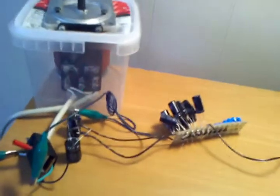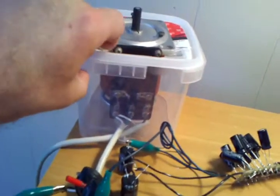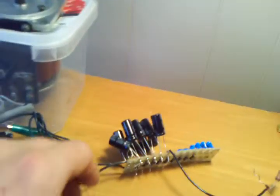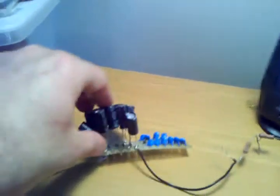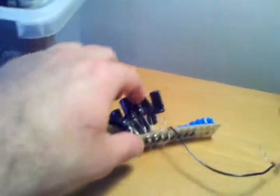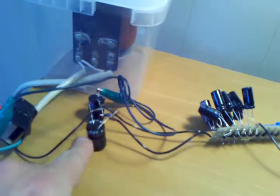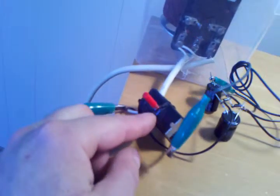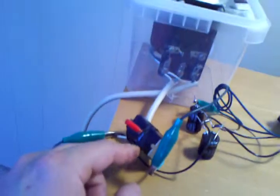This is how I made a simple Geiger counter. It's always good to have a Variac and a voltage multiplier — this is five stages here and one stage here. You always want to have a two amp circuit breaker on your Variac so you don't hurt it.